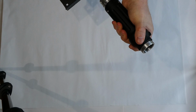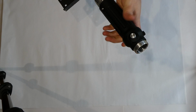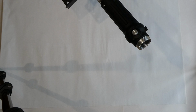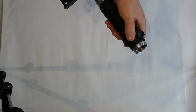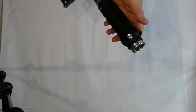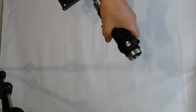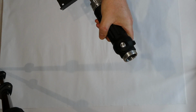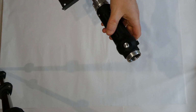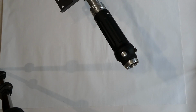So you press it in, and then you rotate, take the finger off, and then you can rotate this all the way around. This is rotated all the way around now to 0, so the throttle is fully closed. Now, this button is locked out. I can't press it either physically or electrically, because we're in this less than idle going to engine off sort of position. And then I rotate round, increasing, and then you hear a click. So that's the wee latch re-engaging, and now you can't move it back. So basically this mimics the way the throttle is on the Huey.